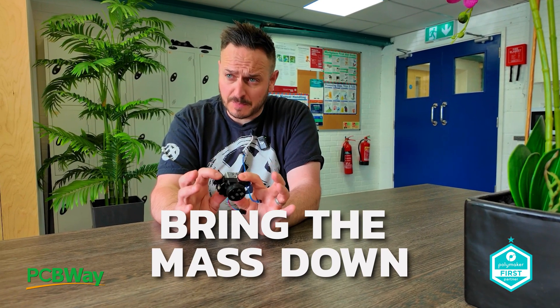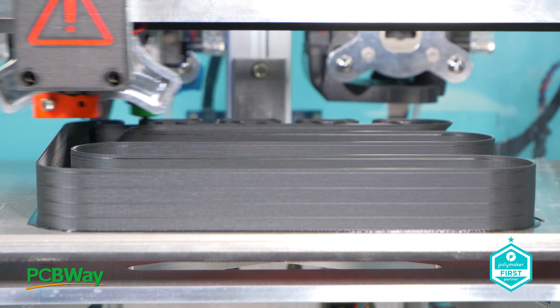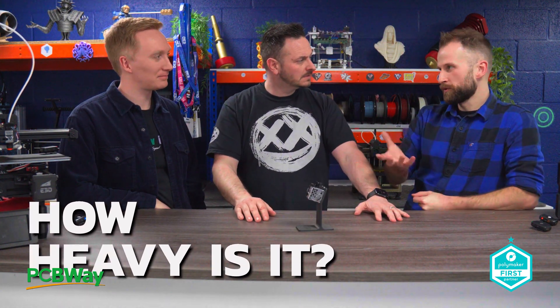So as long as you have enough force, is that not the end of the story? Well, as it turns out, no. In order to make the best product they could, E3D also wanted to bring the mass down as much as possible. The lower you can get the mass of your tool head carriage, the further you can push the accelerations of your print head as it moves around the machine, which means you can ultimately move it faster and push the print speed. The whole Roto extruder comes in at 140 grams — to put that in perspective, that's about half the weight of an x-axis motor like a normal NEMA 17. Your entire extruder is the same weight as half of that.